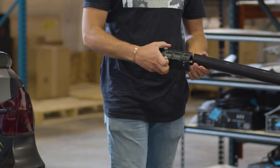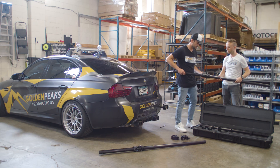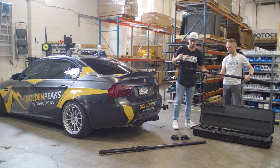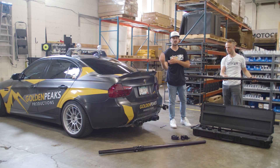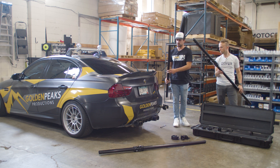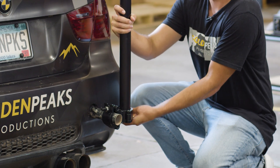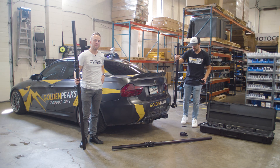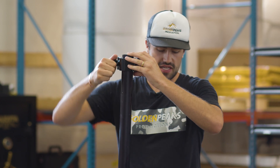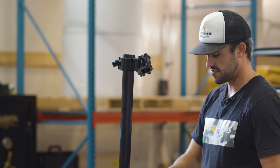As I'm building the car, I'll get all my rail set up and laid out. This is going to be one of the horizontals reaching from the roof to the tow hook, and we'll build the second one now. It's very simple, straightforward, and modular. On pickup trucks or SUVs we'll sometimes do a six-foot section — a four-foot rail and a two-foot rail from the tow hooks to get above the roof line. I always like to put my clamps at the top to maximize triangulation, so the force is always at the edges of the rails offering the most support.